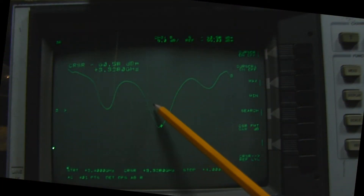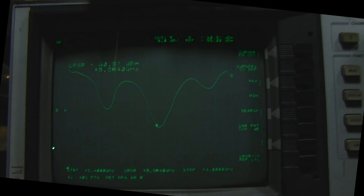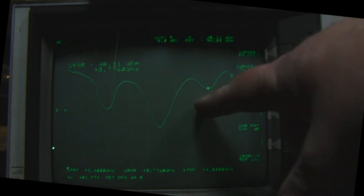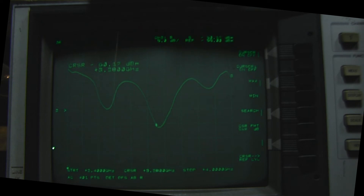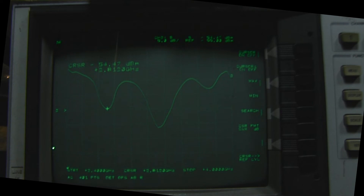Focused on the higher frequencies, we've got two dips. The first dip is right in the middle of the 5G range at 3.3 gigahertz — for 5G we'd ideally want two dips, with 3.6 GHz being the second target, but we haven't achieved that yet. For the 3.3 GHz band mainly used in the UK at the moment, that's a really nice dip. Moving the cursor over, we can see 2.7 to 2.8 gigahertz in the second dip — I'd prefer it shifted slightly, but that's certainly useful for higher-speed 4G.